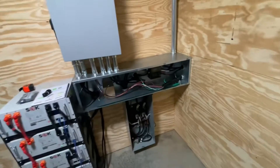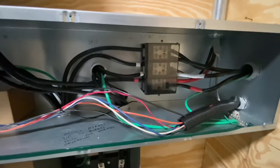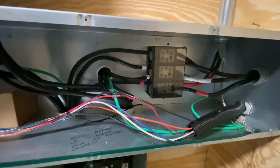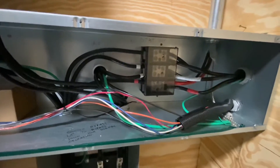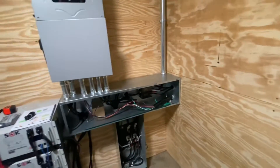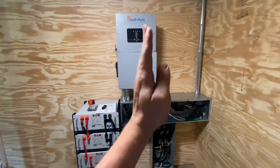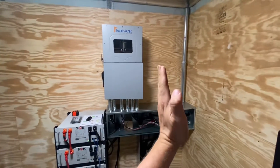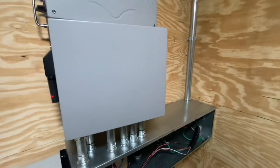A four-foot wire way really gives you a lot of room. That's a power distribution block down in there in its natural habitat — you can watch other videos on how to distribute the output of your Solark to different load centers. This is a four-foot wire way, and the reason I have the Solark on this side is because the customer may want to add another Solark later on.